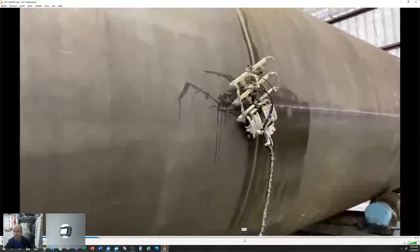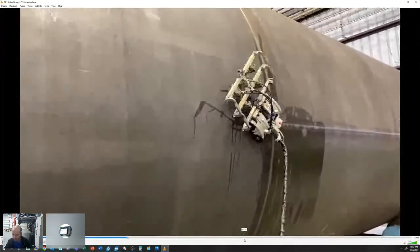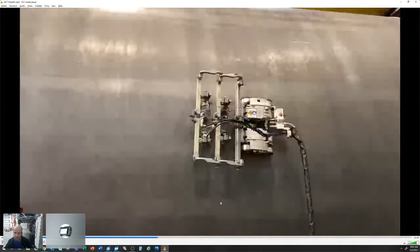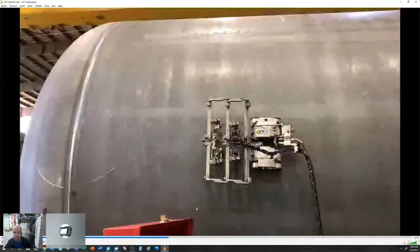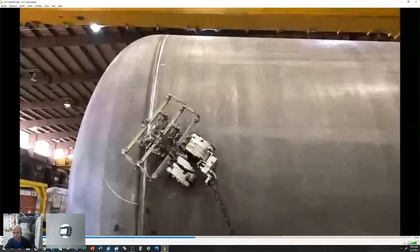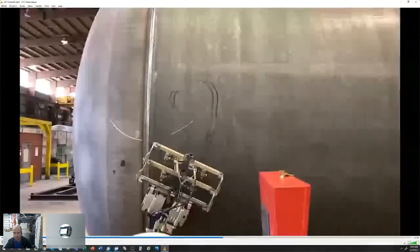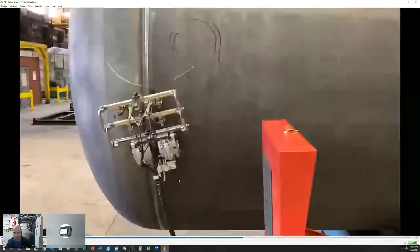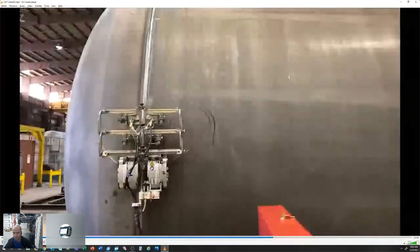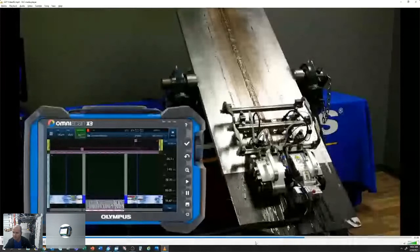See, the SteerROVER, obviously by the name, has steering capabilities, so you can inspect one weld and transfer it over to another, or in cases where maybe scaffolding will not be required, and you can utilize the steering capabilities to get the scanner in position to start your scan. This is going to be the data and setup we're going to go over today on the X3 and in the PC-based analysis softwares.